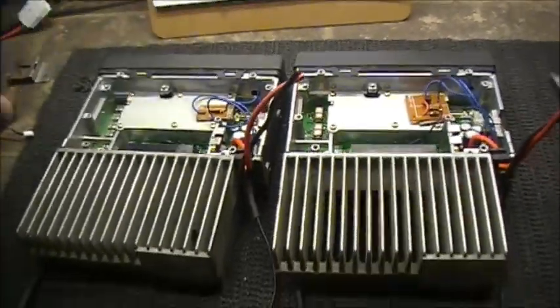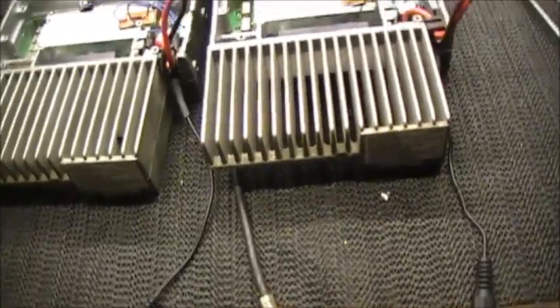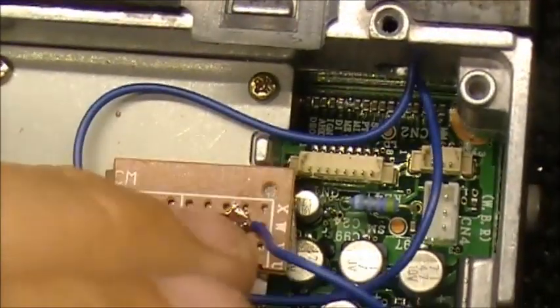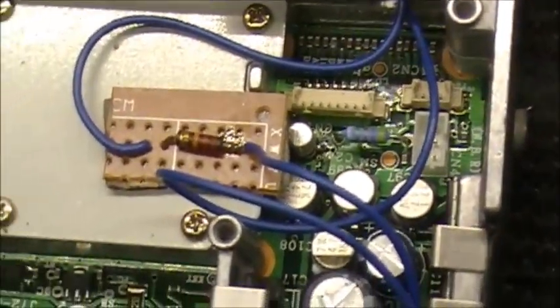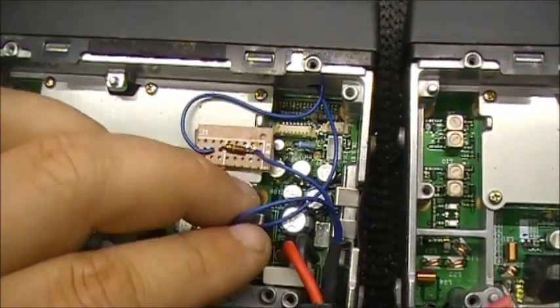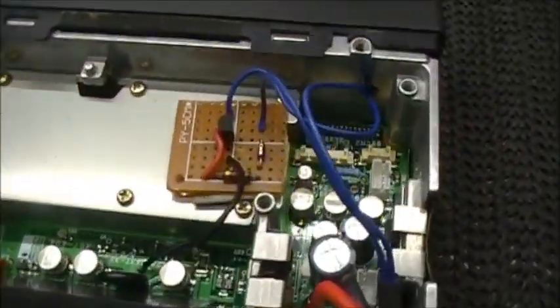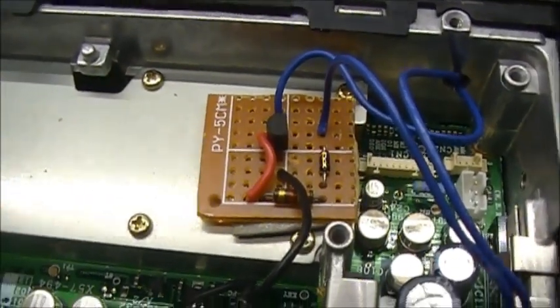This is the first time I've shown the inside of these two radios. The audio line goes through a 22k resistor right here — that's from radio 1. The other wire here is the 5 volts which goes to the other radio. Here's the board layout showing the transistor, diode, and resistor, same as what you see right here.